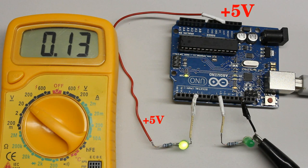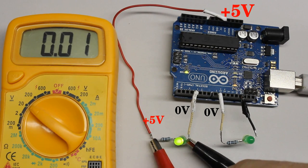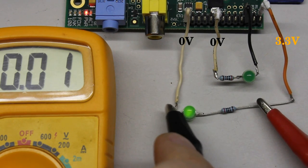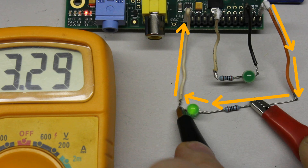As you can see, the LED connected between the positive terminal and pin number 4 is lighted up. We can detect a potential of 4.66V, thus almost 5V across the load. At the Raspberry Pi we get a reading of 3.29V between the positive terminal and the pin being turned off, this load is also turned on. The light emitted by the LED is weaker than that at the Arduino - remember that the current running through the device is below 2mA compared to 40mA at the Arduino. The positive current is running from the positive terminal through the load into the digital pin; it is called sink current - the pin operates as current sink.